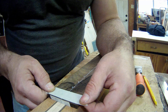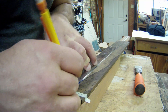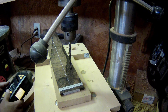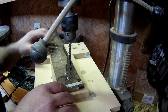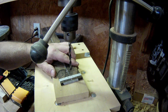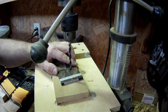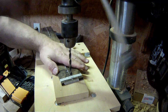Cerakote is a little bit of a pain to draw on. I'm going to make this just a little more than a half inch. I think I have the world's cheapest brad point set — some of them aren't straight, or just barely not straight, so they wind up cutting a slightly bigger hole than they're supposed to. I don't think that's going to be a big problem here as long as it's not crazy. Looking at this one, it doesn't look way off, so I'm going to do the center first. If there is some offness, it'll be in the middle — we'll see what happens.